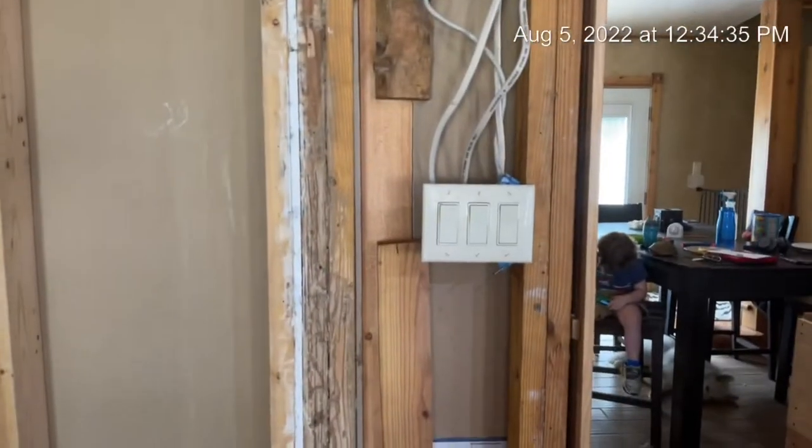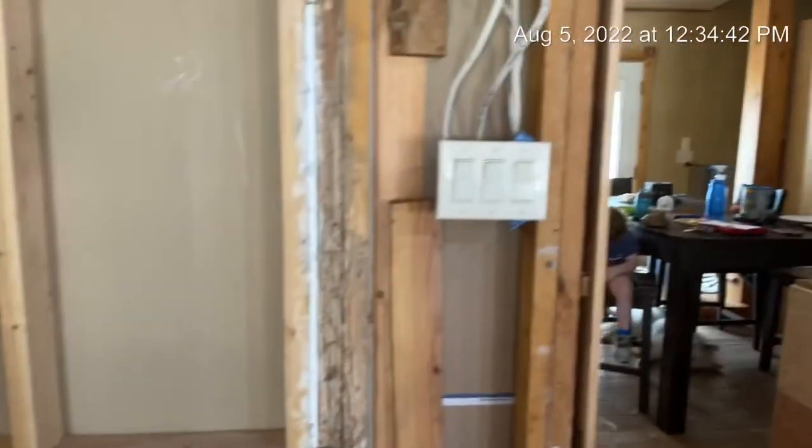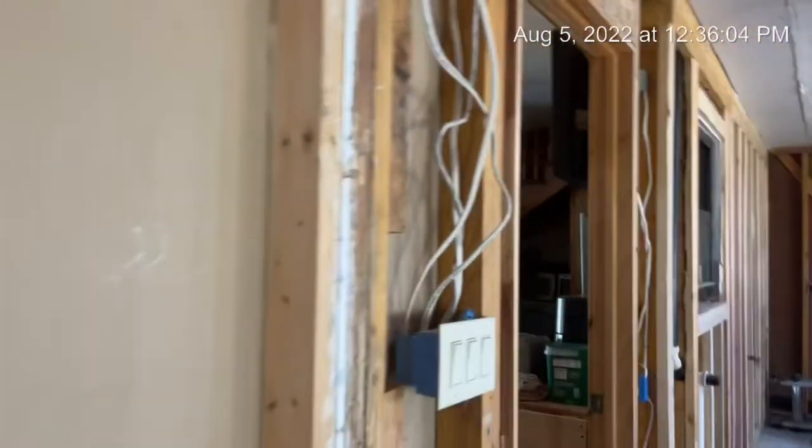Now I need to cut power to this back here and pull these two receptacles off because the studs are going to go up against that. I need to do that bottom plate and then I'll be able to run up the boards. I'm probably going to have to take the sheetrock off this area with all the wiring so I can see where all the wiring goes. I don't know what these go to — I'm pretty sure that one comes up in the bottom of the breaker box, but there's not a white one that comes up in the bottom of the breaker box. Then we've got those two that go running over there, so let me get these loose and then we'll reframe the wall and worry about all that other stuff.